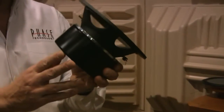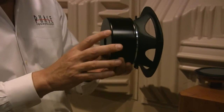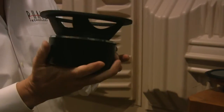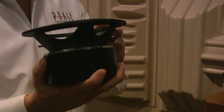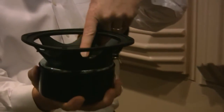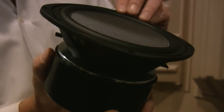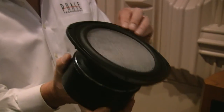One of the other big things you notice is the size of the magnet structure — it's huge. For a conventional speaker, the magnet structure is much, much smaller. What this gives us is added control. The bigger the magnet structure, the more force in the gap where the voice coil moves. And the more force you have there, the more accurate the driver can move. So the combination of a light cone and a very high force factor in the magnetic field produces sounds that are extremely accurate.